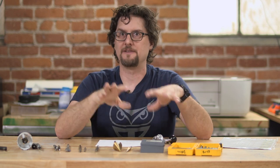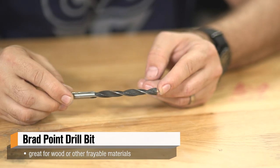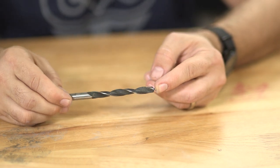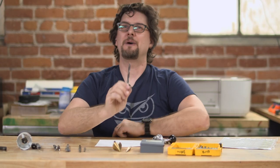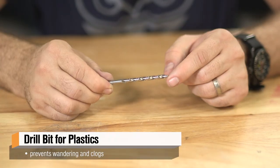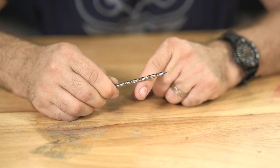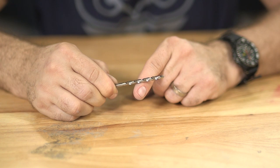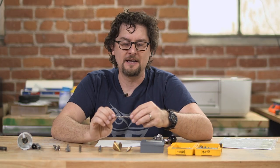There are also bits specifically meant for drilling acrylic that have a kind of spade head on them. Another one of my favorites is the brad tip, which is kind of a tri-point — it has a sharp middle point and two tines on the outer bit. They're good for drilling nice precision holes in wood or other materials that might fray or come apart, such as composites, carbon fiber, or fiberglass. You'll have this nice sharp tip that doesn't want to skitter around on you. Another sharp-tip bit is specifically meant for plastics — it has a nice sharp tip to sink into the plastic and get it started, and the flutes are a little bit different to keep the spirals of plastic residue from jamming up the drill bit, cleaning it out a little bit better.